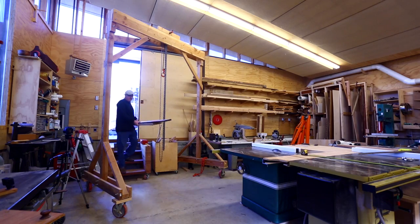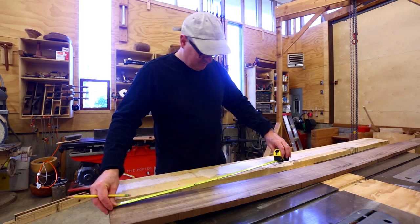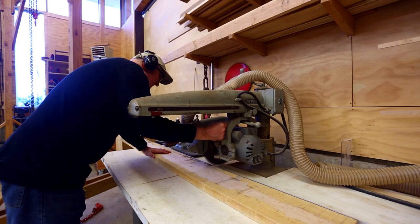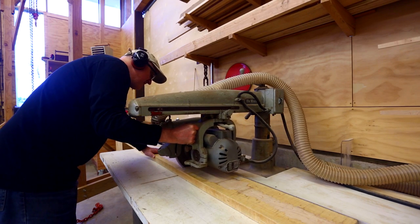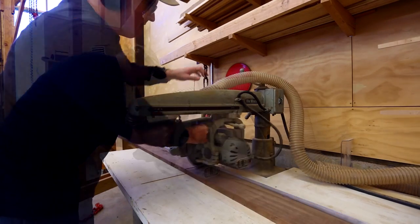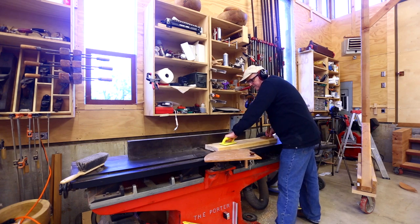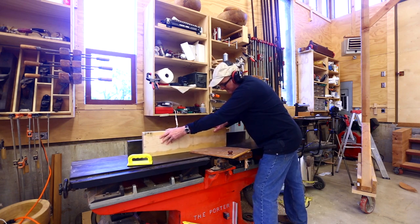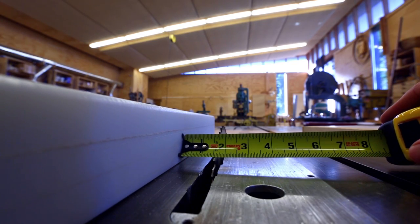I got maple for the lighter color and walnut for the darker color. There's no real story behind the wood beyond that it made nice colors for the pattern. I cut the pieces down to shorter lengths so they would joint and plane a little better without losing as much wood in the flattening process. I face-jointed, then did one edge on the jointer, and cut the pieces into the strips I was going to need.